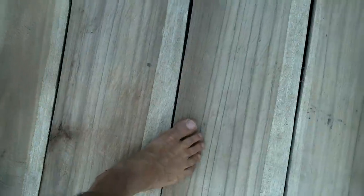So why don't I just take one board and glue it right along the whole bottom? Well, it's because then the floor is all one piece, and if I want to take it off, that's gonna be a huge pain in the butt. This way, I can take off individual boards if I want to save weight for something, or if I need to replace a board or whatever. It's much easier to deal with everything. Wow, that is significantly stiffer now.